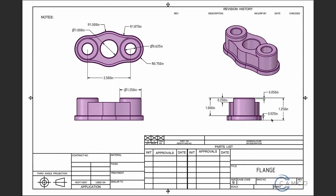The part is an inch and a quarter tall. It has three holes in it — two holes that are five-eighths and one hole that is one inch. The two five-eighths holes are two and a half inches on centers. There's a boss on the top left and the top right. The height of the part is an inch and a quarter, and there's a step of a quarter of an inch on each side. There's a chamfer here, a chamfer here, and a chamfer on each of the holes.